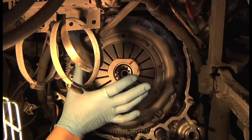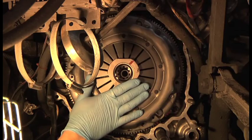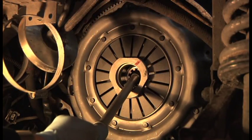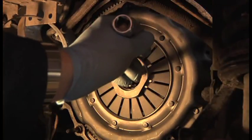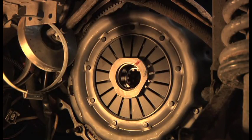But of course, I don't have a spare Ferrari shaft lying around, so I have to do it this way. I'm lining it up just by resting on the edge there, and I can move it around. I don't know if you can see it moving like that, and there's quite a bit more pressure on there now. I think that's about the right sort of pressure for when I push the gearbox bell housing on, to line it up absolutely as it should be.